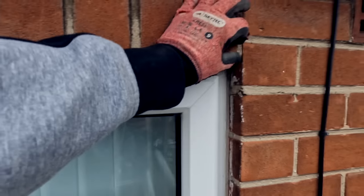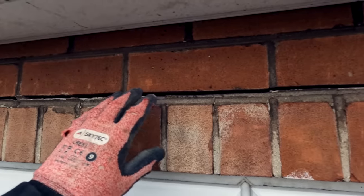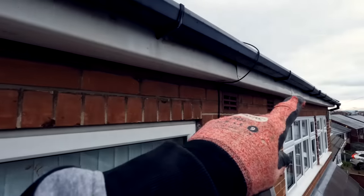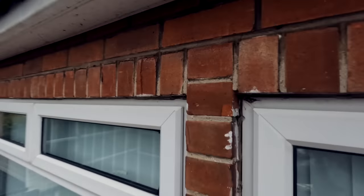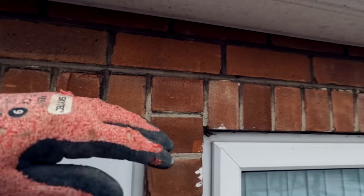I'm not going to bother raising the lintel up, because these windows are staying, so we don't want to put this big gap in here. Plus, these bricks are absolutely massive and we wouldn't be able to get a decent enough match. The bricks we get are like 15mm shorter than that, so it would look a mess. So we're going to take everything out, put everything back. No, we're not bothering with a cavity tray. Absolutely pointless under this facing wooden soffit. Basically it's take out, lintels in, put back.